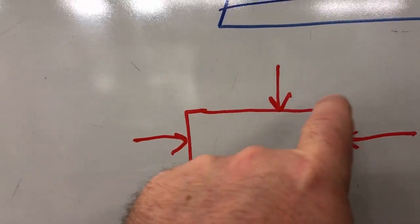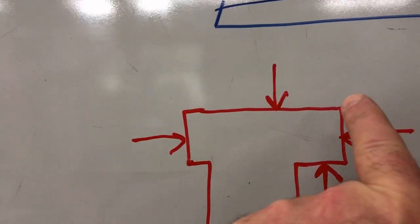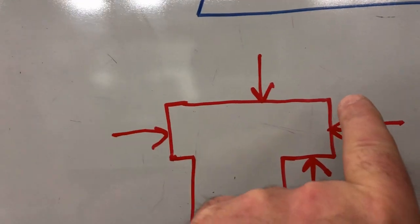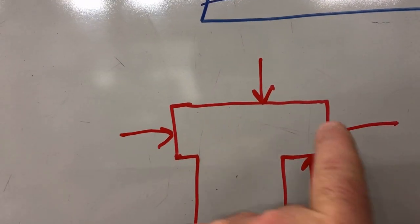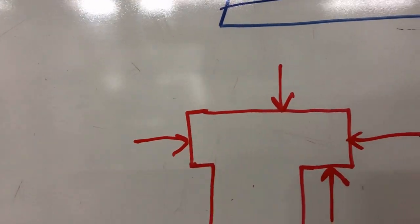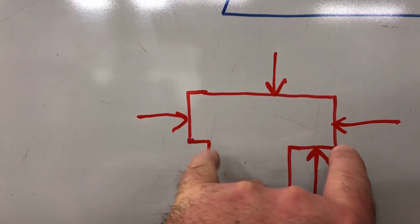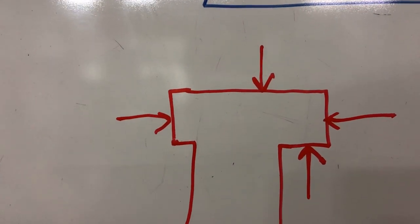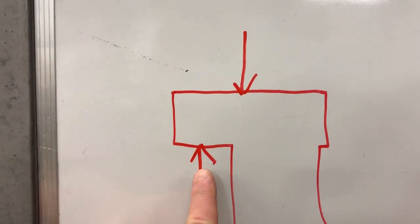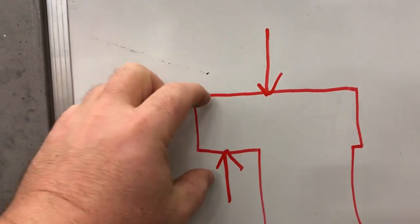When it's new, those surfaces would be very parallel. On the master way, the side surfaces are also finished and very parallel, because a fence comes down from the table that rides on one side, and on the other side is a tapered gib which you use to remove the clearance. They need to be very straight so the table moves in a straight line, and very parallel so the table doesn't lock up in certain places and be loose in others. The non-master just carries the weight and has a keeper to prevent uplift - same requirements: straight, flat, and parallel.